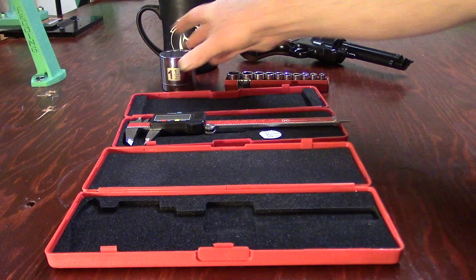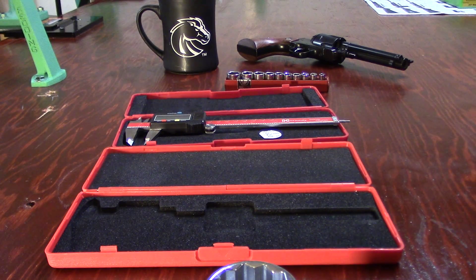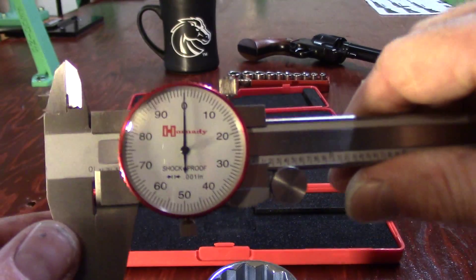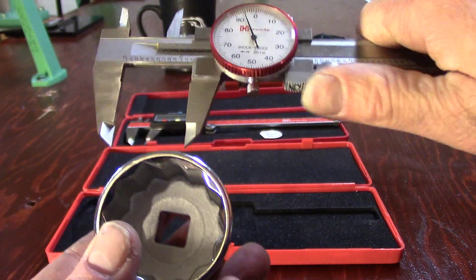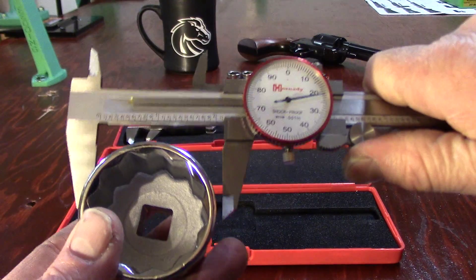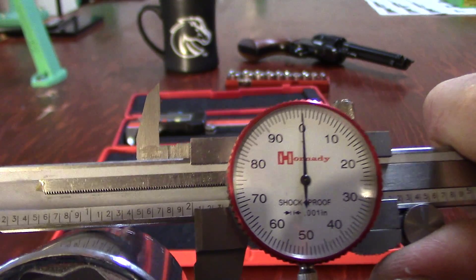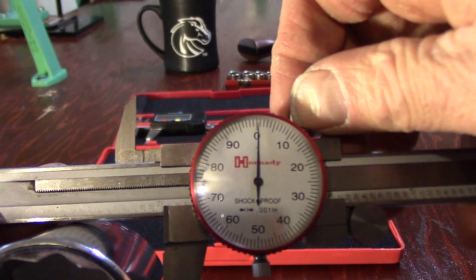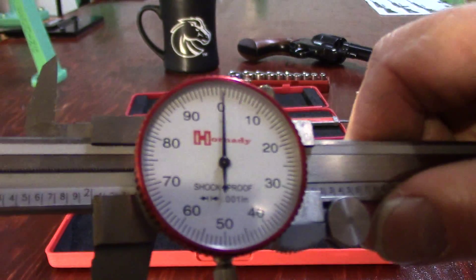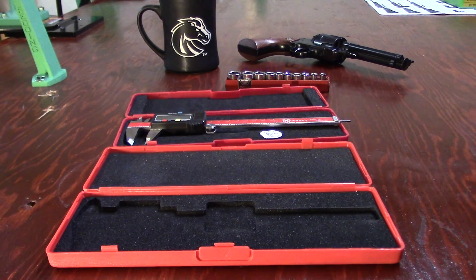Let's clear this and go for the larger socket. It's brand new - I scored it for like 50 cents at a pawn shop. I haven't used it but it was a cheap socket to buy. Starting back at zero, let's go ahead and only run them with your thumbs like this - don't just grab the jaws and open them with your hands. Now as you saw that fluctuated two thousandths because that's not perfect. So now we have to read this.